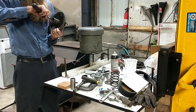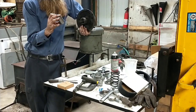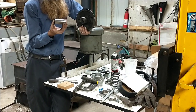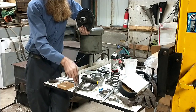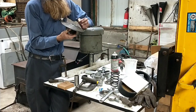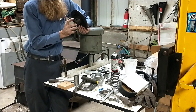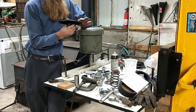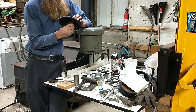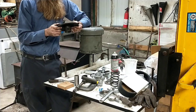You can't leave any of it behind, because here's the problem. You've got this arbor, and you'll see this process now, but this gets the bushings to the right size when we're installing them, but the problem is it doesn't guarantee that you're on center. You know, there is a thin film of, in this instance, urethane going behind that bushing. And the problem is if you leave any of the old stuff behind, you run a good chance that you get basically held up on that bit of old stuff and that now your bushings are a bit off center.